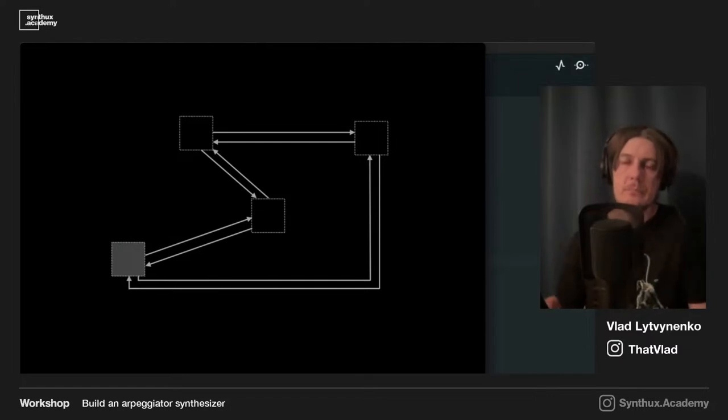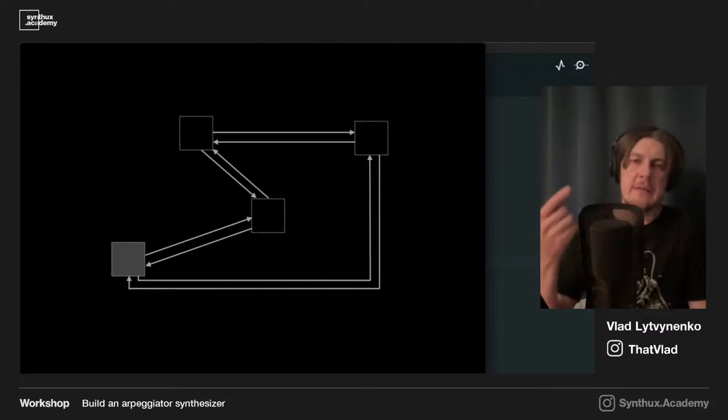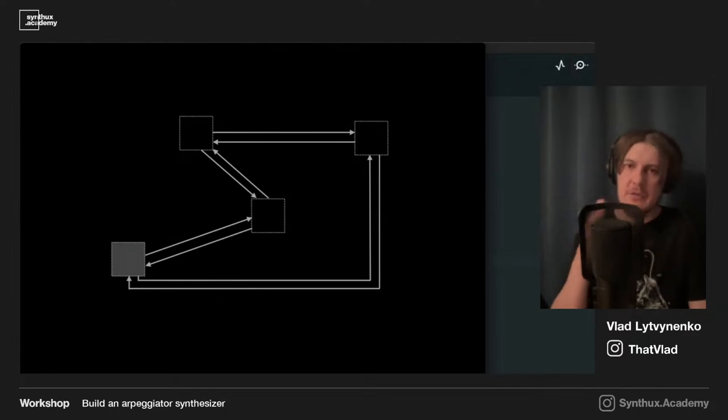And so what we are going to use here is actually a hybrid of it. The elements will still be sitting in the array, but they will look at each other through those next and previous references. So we have the best from two worlds. We can do insertion with constant complexity, and also if we need to quickly iterate through them with indexes, we still can, because they are actually sitting inside the array container. So yeah, that's the idea.